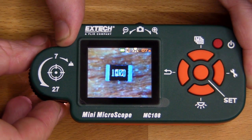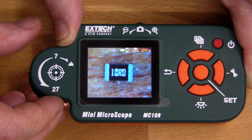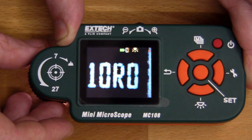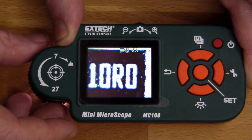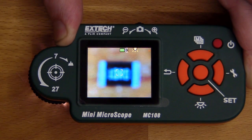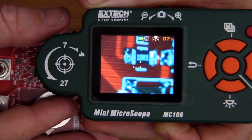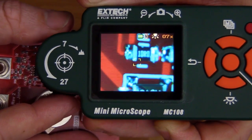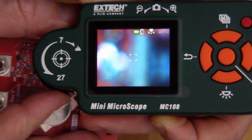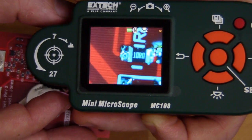Let's use the X-Tech microscope to look at the resistor from the batch. It looks pretty close to my original ones. There's the identifying mark: 10R0, which indicates it's a precision resistor. Comparing with the one on my original board — it looks like an identical resistor. So I think it is actually the correct type, but why it's several percent out, I have no idea.